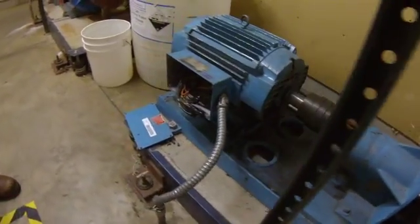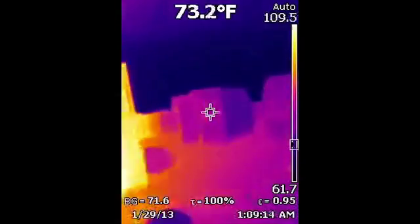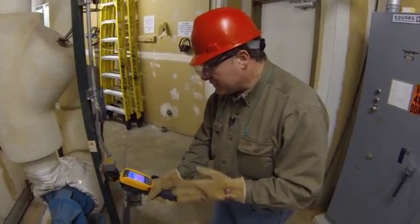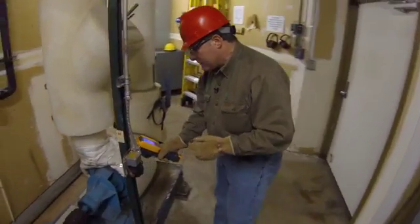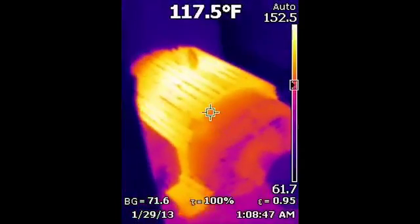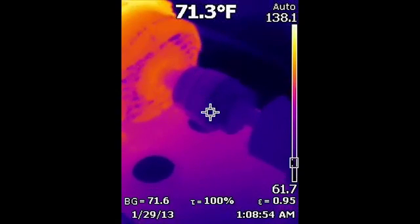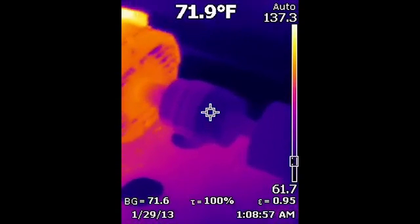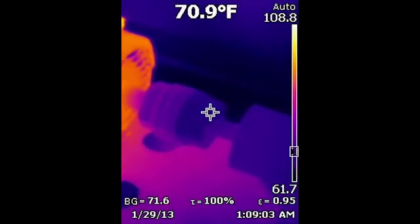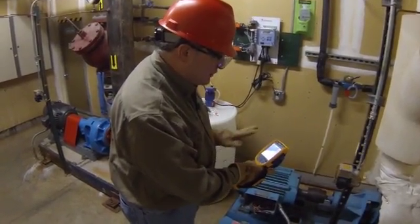You have to be a little bit careful when looking at couplings and shafts because they tend to be a shinier metal — a lower emissivity material. Sometimes you can get reflections off of them that aren't really there and aren't indicative of actual heat. I see a little bit of extra heating on the motor side of the coupling, but that could be an emissivity issue. I'm not seeing anything significant, and because I'm not seeing any excessive heating on the bearing of the motor itself, that tells me the alignment is probably pretty good. Moving to the pump side — no issues there; I think this is operating really well.